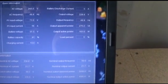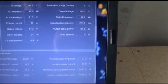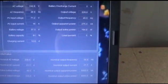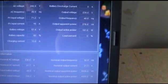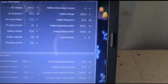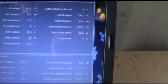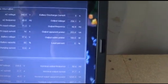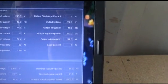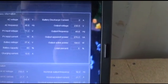As soon as the sun goes in, I'm producing 16 amps off the panels, with 13 amps going into the batteries. The remainder is running all the items I'm using at the moment — about 3 amps off the panels running everything upstairs. That fluctuates when the fridge kicks in, the freezer kicks in, or someone turns the water pump on, and of course that goes up.